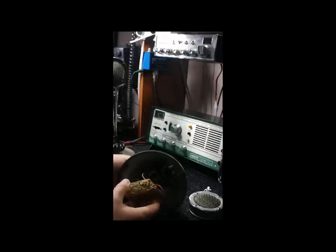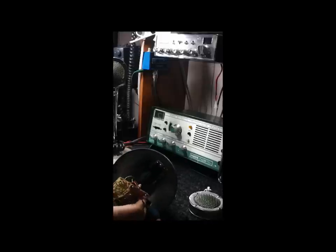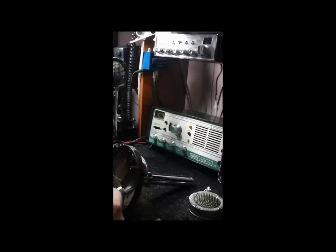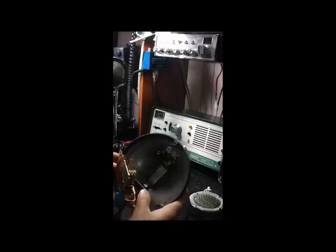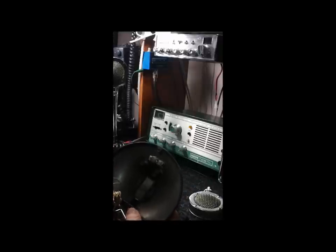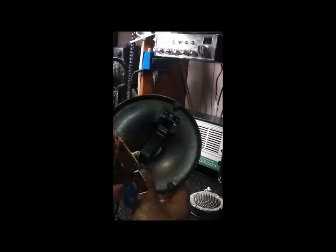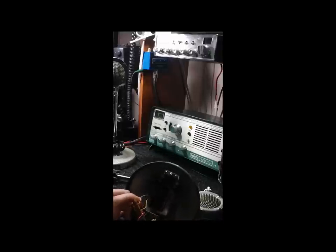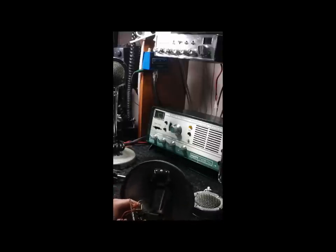This is not exactly as I had remembered. There are your relays — I want to be careful here. There's where your Lazy Bar connects. You probably can't even see any of this — I don't have enough room to set the camera behind me, so this is kind of cheesy, I know. There's where the Lazy Bar mounts, there are your relays, and that's what we want to clean. I've got a little relay file — a lot of people have different methods, but I use a relay file.